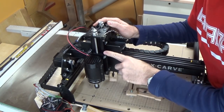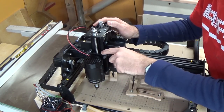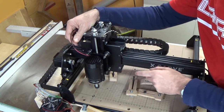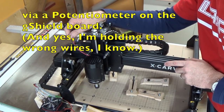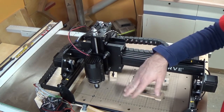Here's the z-axis. I had a little trouble when I first set it up — it would go down fine but coming up it would just sort of jerk and hesitate a bit. I added a little bit of 3-in-1 oil on the threads and also increased the voltage, which you can do on the G-Shield. Both of those I read on the Inventables website forum, that other people had done that. That helped and now it just goes up and down smooth.